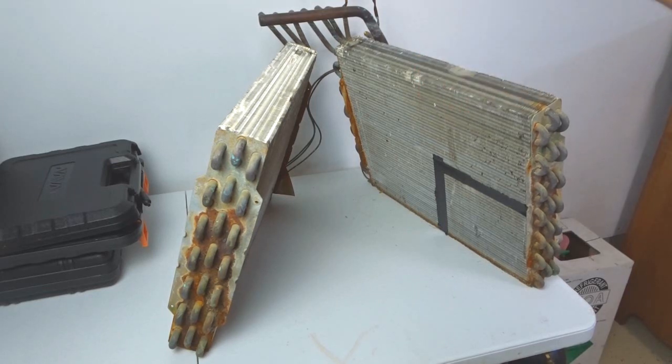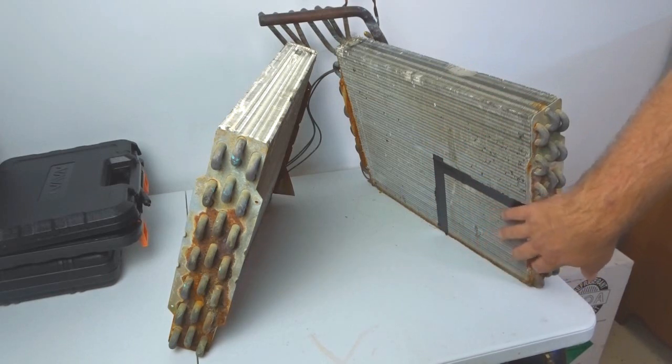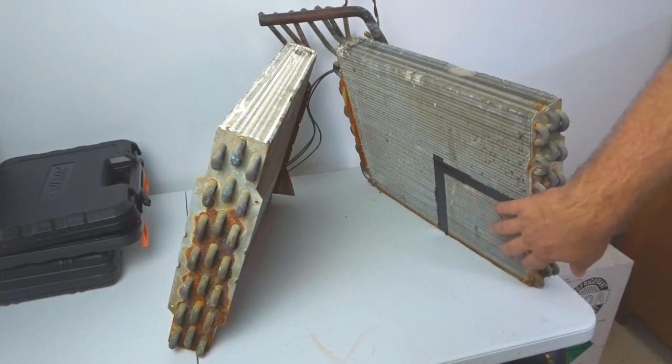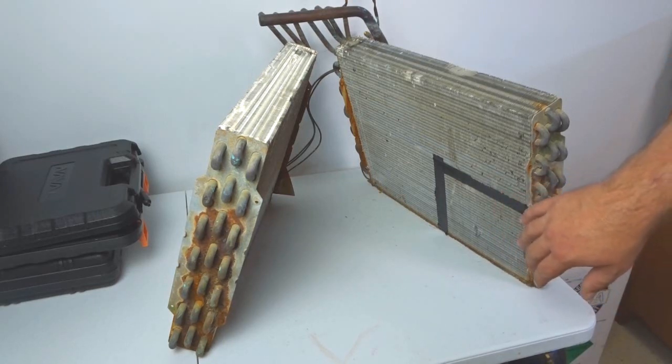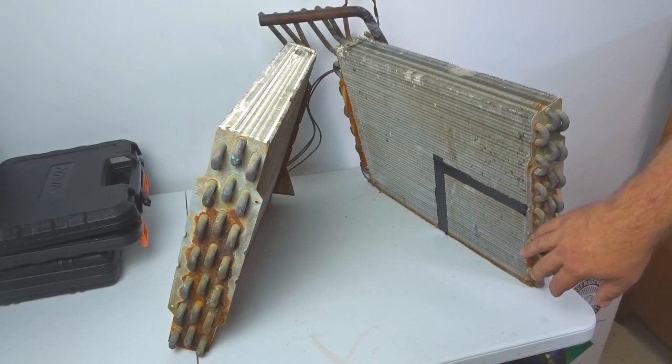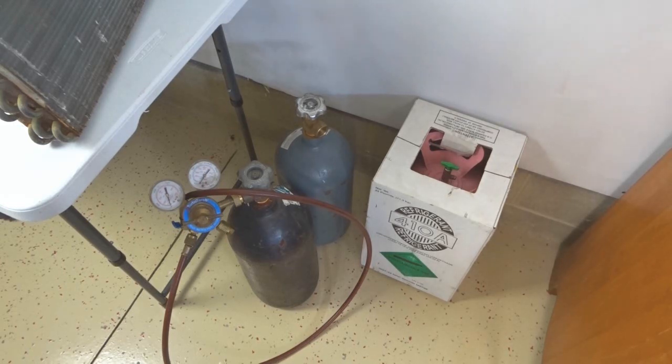You know that if you hear one, two, three little blips and nothing else, you wouldn't be satisfied with that in the field. You want to hear the nice long tone or ring off that will indicate you actually have a leak, and we'll define that as the process goes on. We're going to take our 410A and put some into the coil and pump the rest up with nitrogen, up to around 200 PSI. We'll do a 200 PSI test, 100 PSI, and 50 PSI, and go lower if needed.